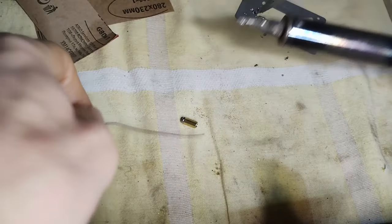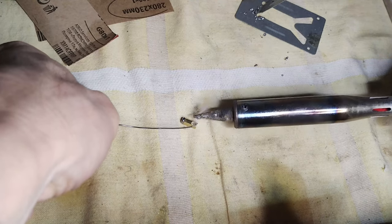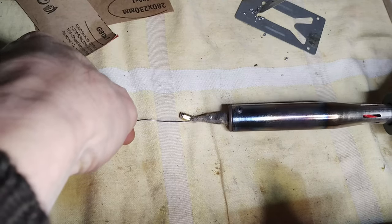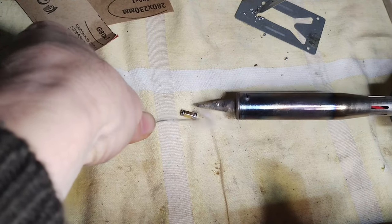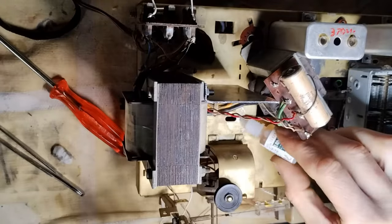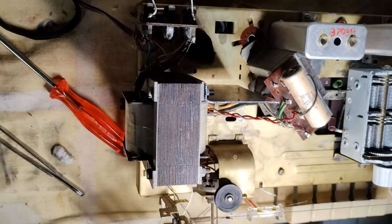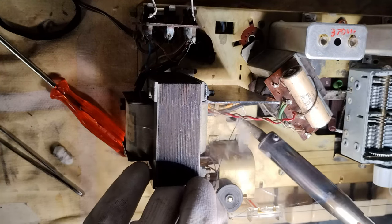For the purpose, two brass standoffs were soldered, but before that they had to be prepared. Closing one side with a screw was necessary to avoid filling them completely with solder. Some flux liquid was applied before soldering on the chassis. However, later it was found that using a very hot soldering iron, just applying Vaseline oil for this function was sufficient on this chassis.